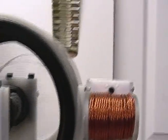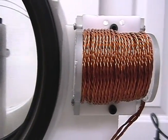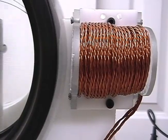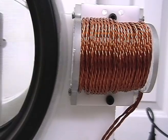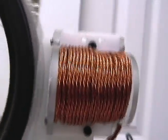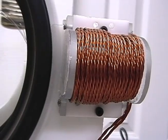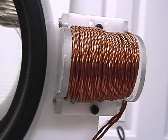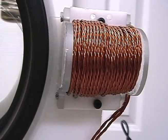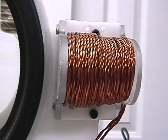The biggest drawback I've found is the efficiency of the motor, and if you look at any commercial motors, it's the coil design. If you look at a common motor now, the distance and how it's arranged allows a maximum amount of torque, whereas this design — even though it's only briefly pulsing — you're losing a lot of energy based on the design. It's home-built, not highly machined, so the coil should be using transformer laminar plates and be millimeters from the wheel to give you the optimum amount of torque. This motor isn't likely to achieve that, and neither are any of the other pulse motors being built out there.